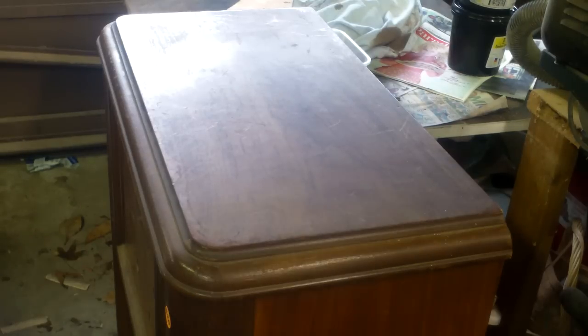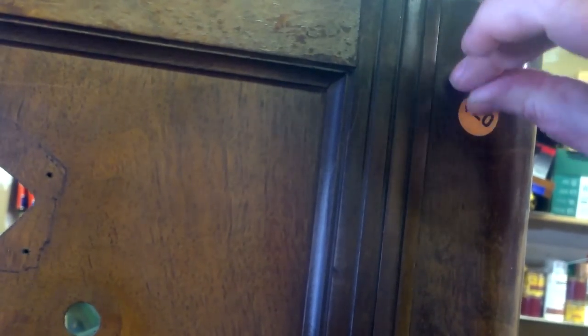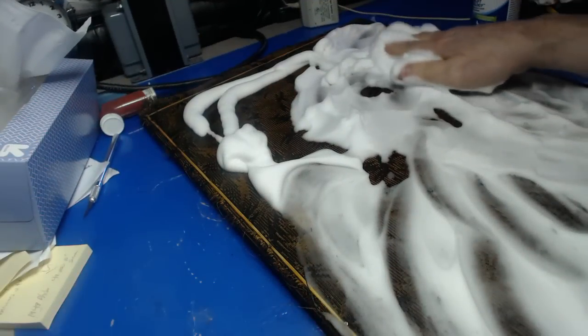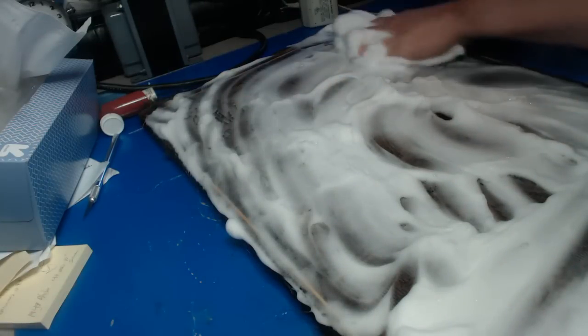There's the top of the cabinet here. I'm just gonna put some mineral spirits on and try to clean it up — not too bad. There it is after a mineral spirit bath. It always looks great after the bath. Looks like some brown paint dripped down here — I'll have to get that off. We'll let that dry and I'll probably do the Howard's tomorrow. Maybe it'll warm up a little bit. I decided to do a second coat just for future reference, because once I took all the suds off it looked pretty good.